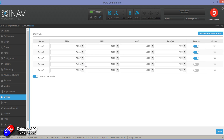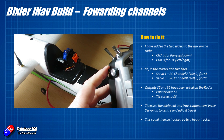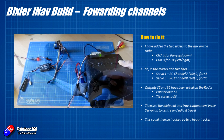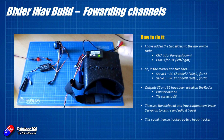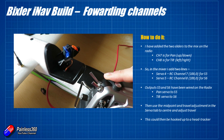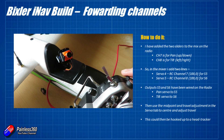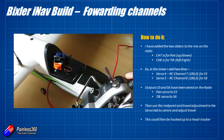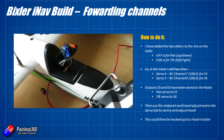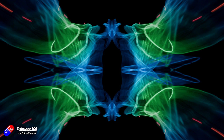Once you've done all that, you can disconnect, go back to the bench, and test it — and it's all working beautifully. Of course you could connect this up to a head tracker, and I have a video on how to use head trackers with setups like this. Hopefully that's interesting and helpful: just add two extra channels from your radio using the servo mixer, expose those RC channels onto spare servo pins on the flight controller, plug the pan and tilt servos into those outputs, and optionally go the final step and set it up with a head tracker.